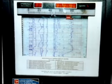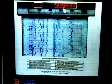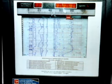We've just mentioned the potential overheating of boiler tubes due to lack of water. But as we have mentioned before, we can also run into overheating of superheater tubes during startup due to lack of steam circulation through the tubes. It is quite common to monitor the temperature of superheater tube metal, as this provides useful information during startup. In most installations, the superheater tube metal temperature monitor does not trip the boiler, but it does actuate alarms when the temperature rises to an abnormally high level.